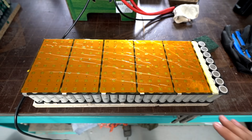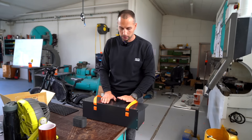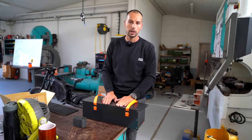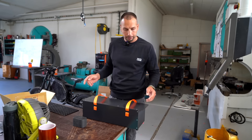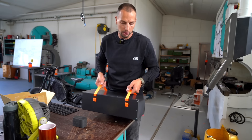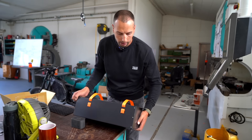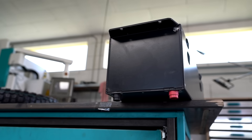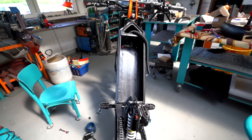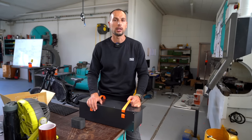Once welded, we protect the whole side with Kapton tape, then it's wrapped in a rubber mat — three times protected before it goes into the aluminum powder-coated case. We CNC cut this aluminum case at the workshop on a laser cutter, then it's bent on a CNC press brake and powder coated. It has handles for much easier loading into the frame of the Havok. Our latest improvement, which I'm particularly proud of, are these two positive and negative connectors. Opposite pieces are installed straight into the frame — as the battery slides in, it sits exactly on the connectors and connects to the whole system. Pretty killer feature.